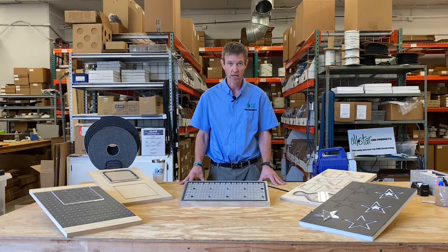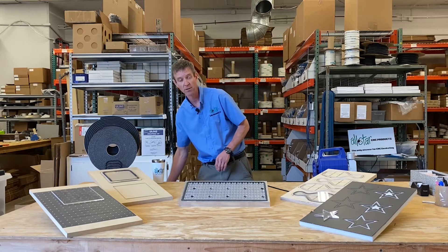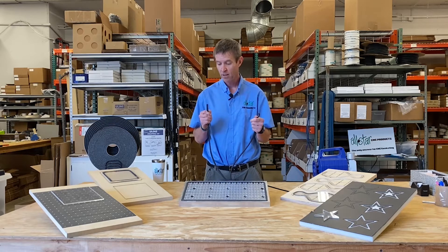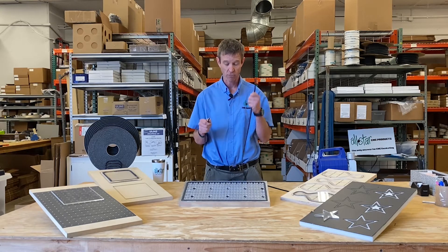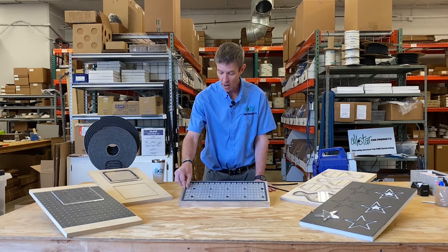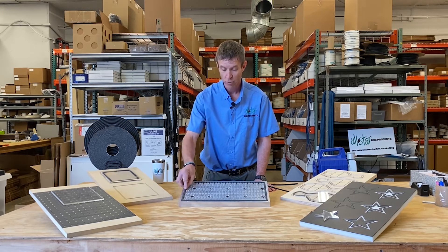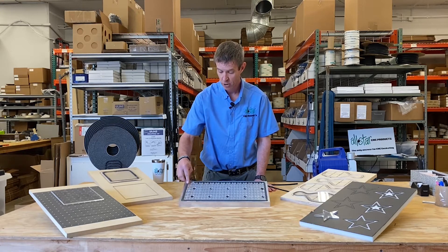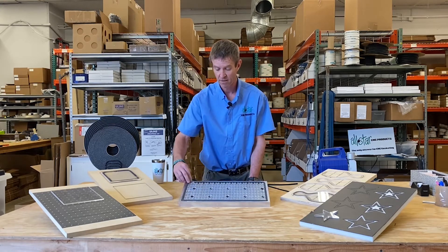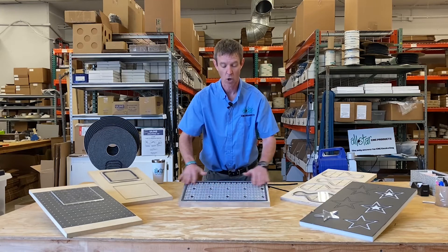The first one we'll look at is what we call a grid gasket. Grid gasket goes into the grid of the table itself. Machines these days are all milled to different channel dimensions, which is why All-Star carries both square and round products. We find that the square gaskets work best in square channels and round products in round channels. A very common size these days is the quarter-inch wide by quarter-inch deep channel. With a quarter-inch wide channel, you should use a quarter-inch wide gasket so you're not stretching or mashing it — a nice even fit.